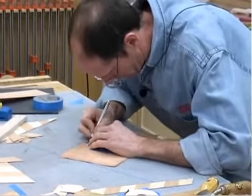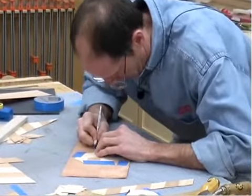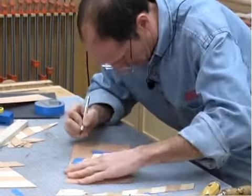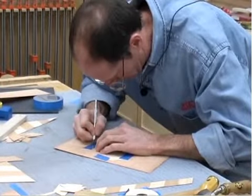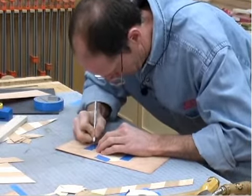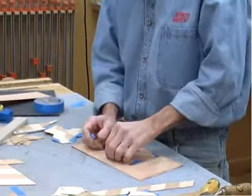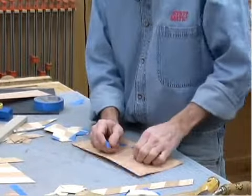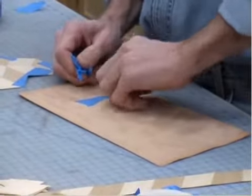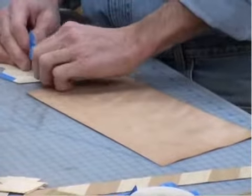I'll just follow around right off the edge. If you cut a little bit beyond your line, nobody will ever know. If you cut a lot beyond your line, then you've got a problem. One more cut here — I haven't done the best job in the world going around this. Now let me take off the veneer tape. We only want veneer tape on one side, or blue tape — we don't want it on both sides. I'm going to take all the tape off this side, and since the majority of the tape is on the other side, I'll go ahead and peel off this tape as well.